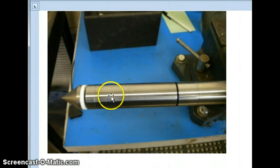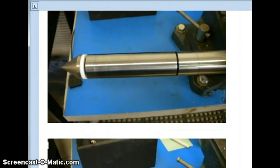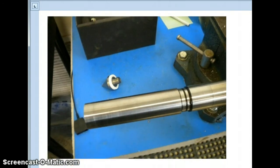Holding the cone secure, you can unscrew the tip — that would be this here — and a pore pressure element. Unscrew the tip and pull the sleeve off. Here's the sleeve coming part way off. There's the tip and the pore pressure element. And here's the O-ring that is visible on the surface and a couple of O-rings underneath on the sleeve area.